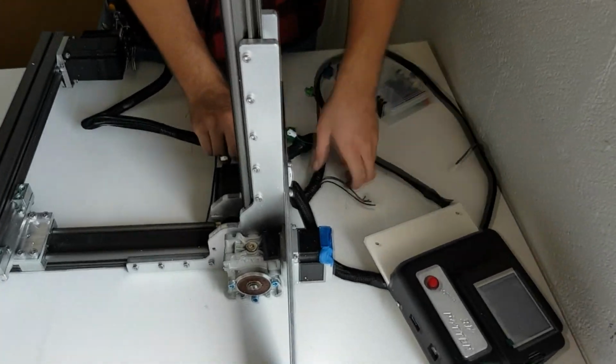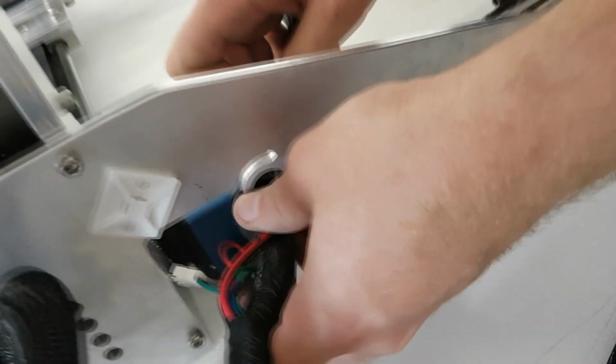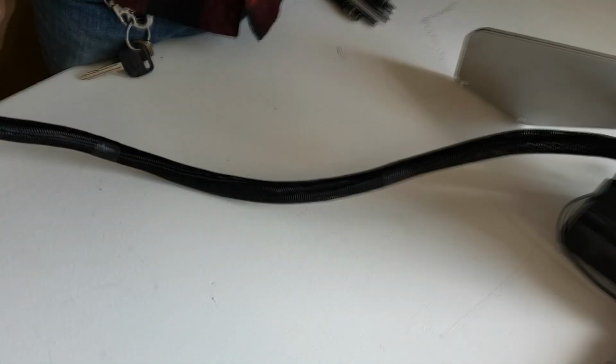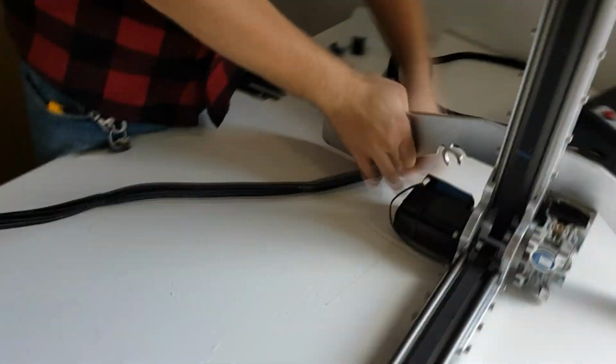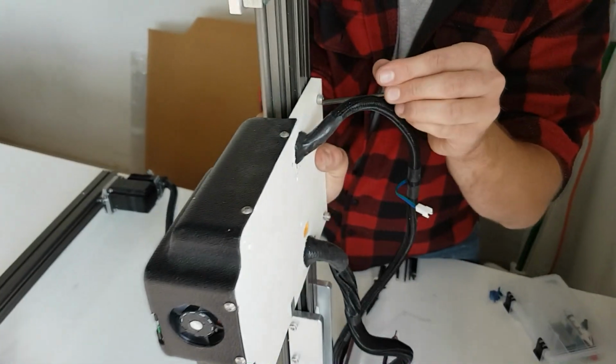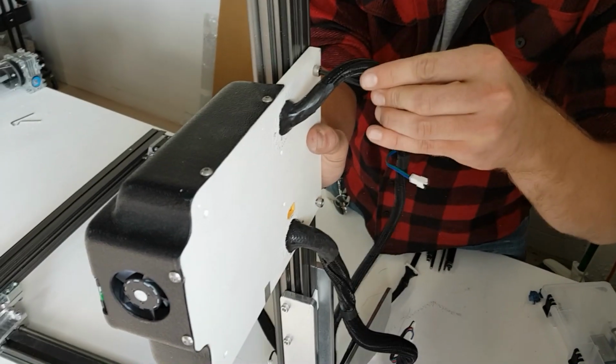Go ahead and put the cable into the slot for the grommet, as shown here, just so it's secured and out of the way while prints are running. As you can see here, we're just adjusting the screen again and rotating it so there's maximum slack on the cable harness. On the back there are two square nuts already glued in, and all that's needed is to have the screen attached to them, like so.